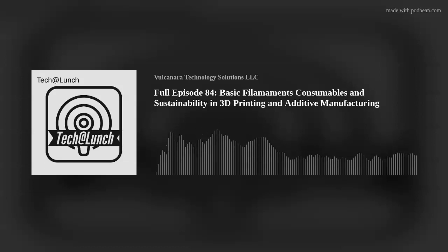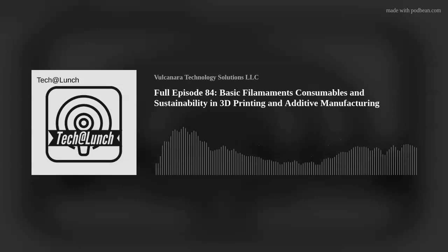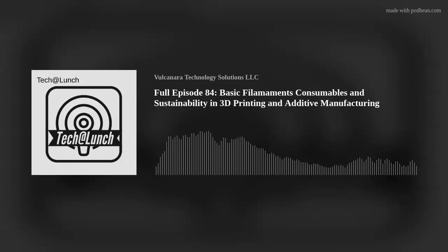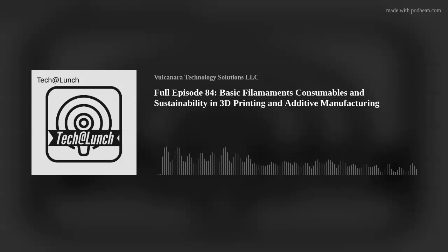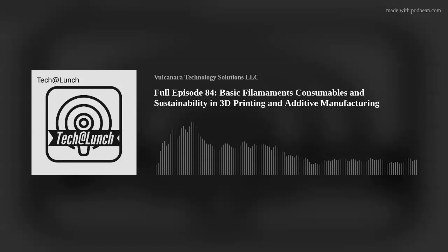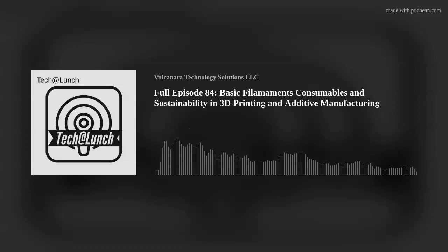If it's not exposed to UV light, it's PETG all day long, or a high-infill PLA. If it has to be exposed to UV and withstand outdoor temperature changes through the seasons, it's going to be ABS — because of that unknown factor of UV. If it could go either way, I'd say ABS, because ABS handles that outdoor craziness.